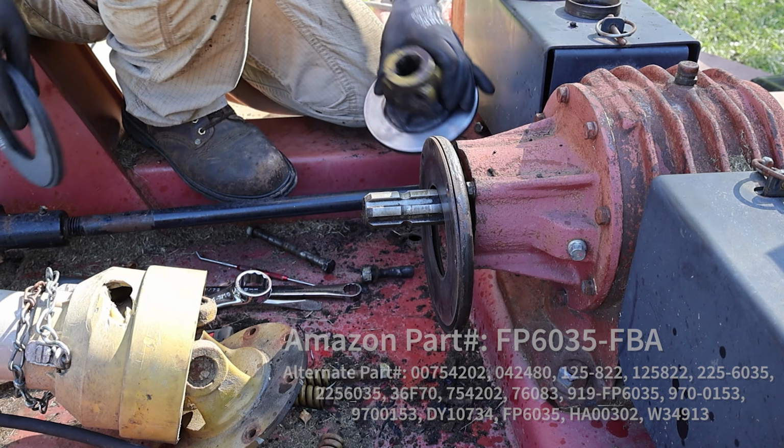And this is pretty important. I don't recommend taking a shortcut here. Otherwise you'll get slip clutches that wear unevenly. Try that. A little more. Tiny bit. Looks pretty good. We've gone all the way around now that the plate and everything is nice and flat, and we need to make sure everything's good. So that one actually needs to come just a tiny bit more, tighten it in just a little more. I think that's it. Is that it?